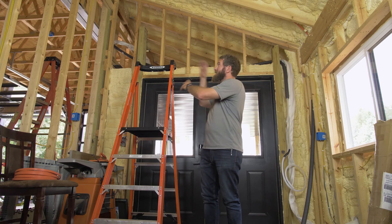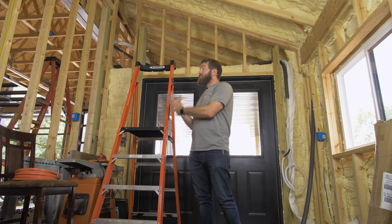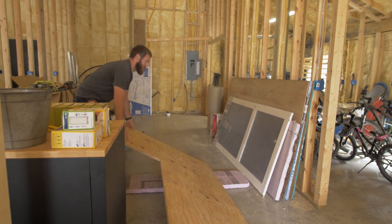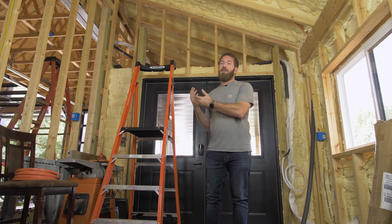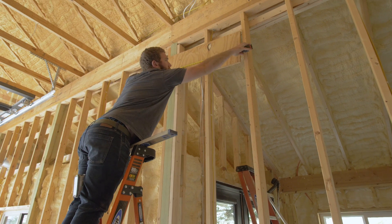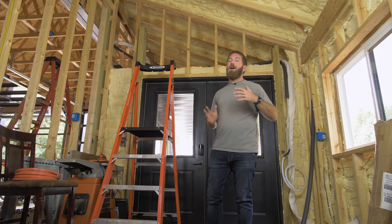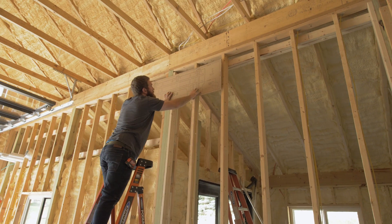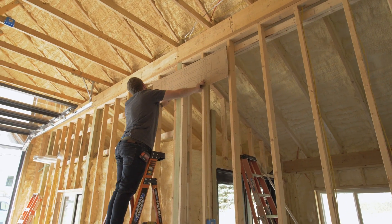When it came to installing the indoor unit, I wanted to make sure that we could add drywall later whenever we get around to that. So what I did was I spaced it off the wall with a piece of plywood — I believe it was half inch — to match the thickness of the drywall that will be going up there. I cut it a little bit smaller than the outline of the unit, so the drywallers will be able to tuck the drywall up behind the unit and it will look like the drywall continues throughout the back of it.